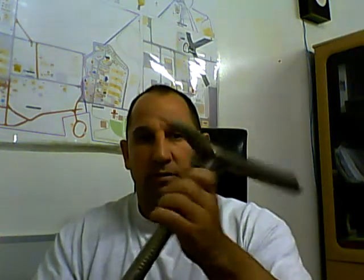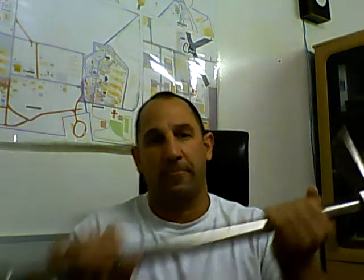Then on the other end of the tool, you have a thinner piece of flat metal that can be used to stick into door jams or anywhere you might need to, such as under floorboards. And then you have the spear — the tip, or tapered pick — which also has a slight angle to it, so it can also be used for prying. So there you have it: the 30-inch Halligan Bar with three types of tips, which can be used for multiple purposes.